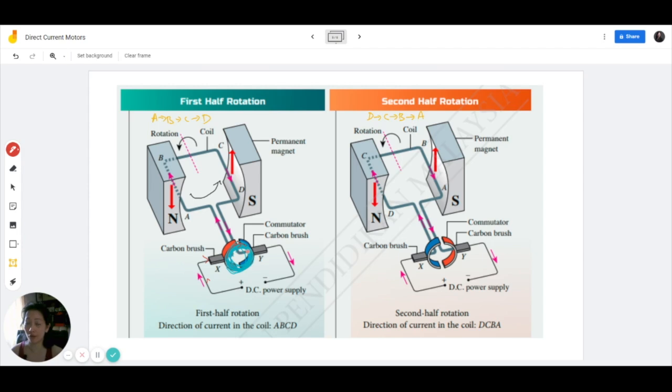If you have forgotten what a short circuit is, check out my video on short circuits. The current is going to completely ignore the coil and flow only through the commutator and back to the other terminal. As a result, because there's no current flowing into the coil, no current flow means no magnetic fields around the wire, hence there's no interaction and no force. So the motor is not going to spin.